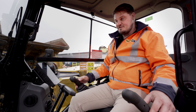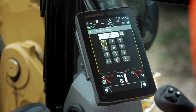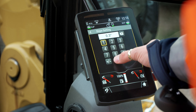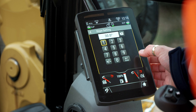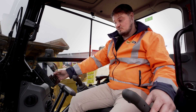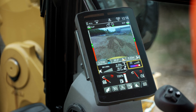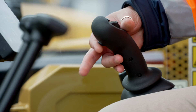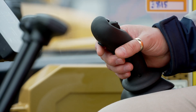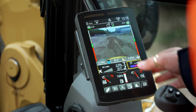Also in this system, if I tap on target slope, I have the ability to add slopes that are falling away from me or coming down back towards me. You can see that we've got the target slope of 30 degrees and an offset of 200 millimeters. To bench, simply push the front button on the joystick, and I've now set that bench back to zero.